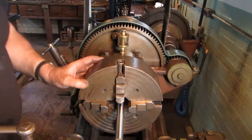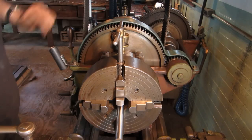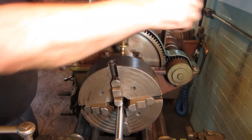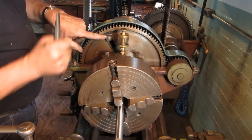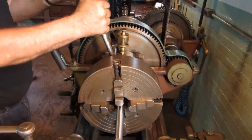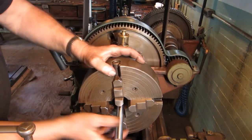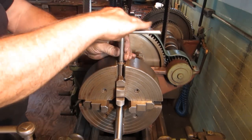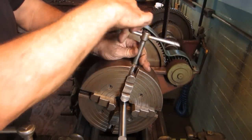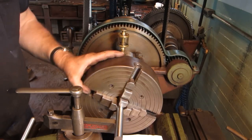We're getting along on the setup on this valve rod. I had to change to my smaller chuck because the bigger chuck wouldn't go down that small. This nut here and stud unlocks the stepped pulley from the spindle, so it'll turn free without the back gear engaged. And we'll just run these down. In the ballpark. Just touching there.